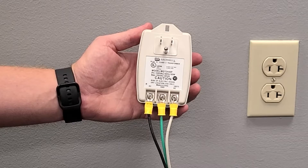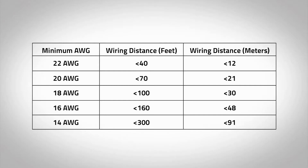Run a 24 volt AC-DC wire to the installation location to power the INSPV. Note: Class II transformers are available for a 120 volt application. Wire gauge must be considered when running power for long distances. Minimum wire gauge is 22 AWG.